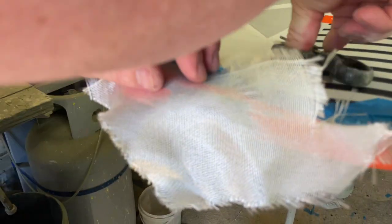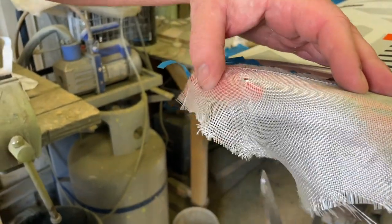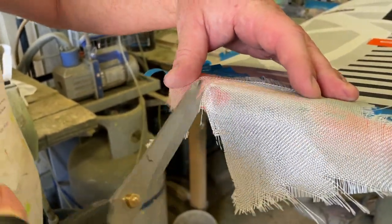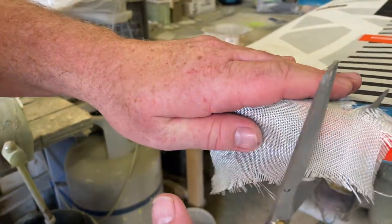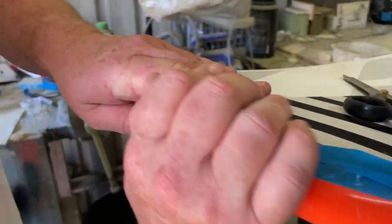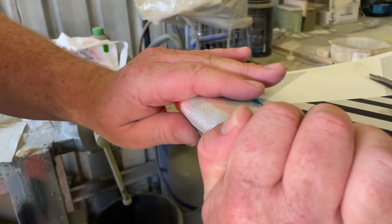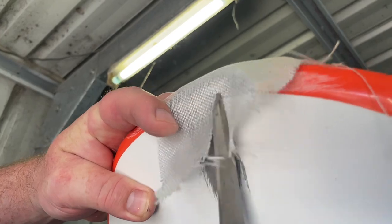Make sure your glass fits before you bother cutting it - there's no point cutting a big bit of glass with all this extra. So let's get it to the shape we want first. You're cutting the fibreglass to where you've sanded to? Yeah, we're going to go a little bit past that, but I'll show you when I laminate it. Getting a bit of the shape going and cutting off the excess before we start doesn't hurt - getting it to conform nicely because we're only going to have one or two layers on here.